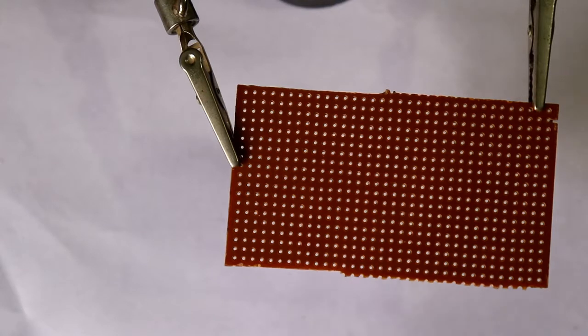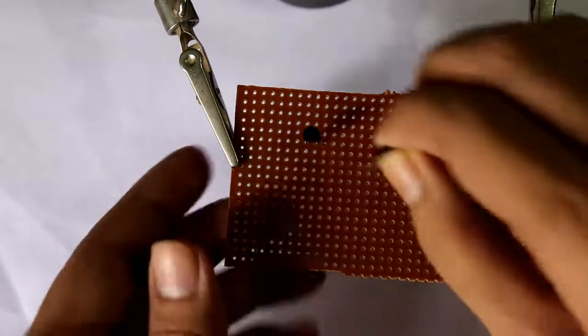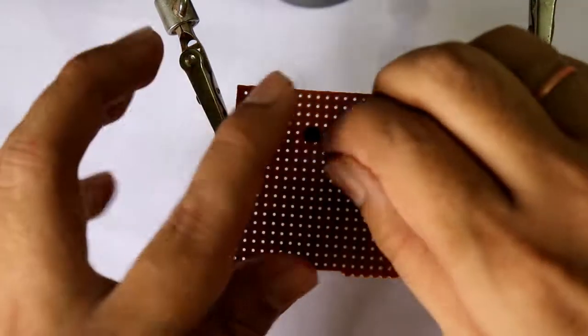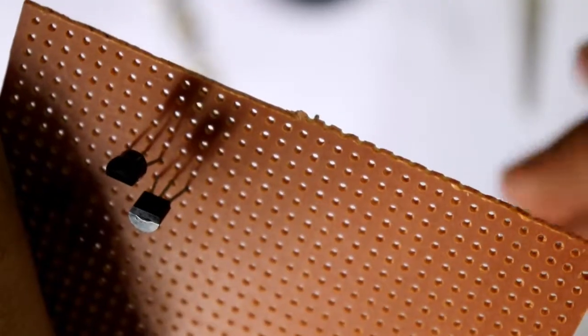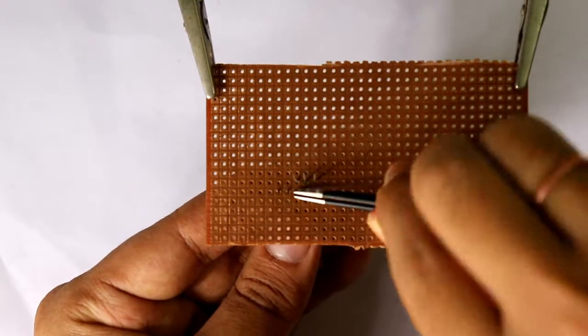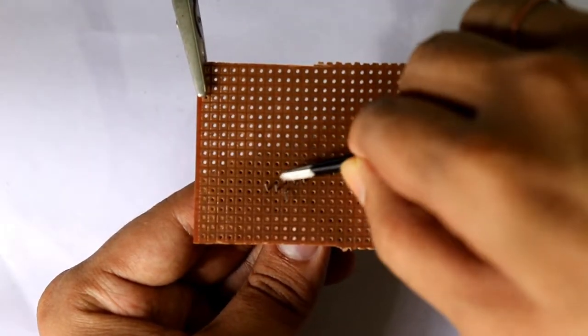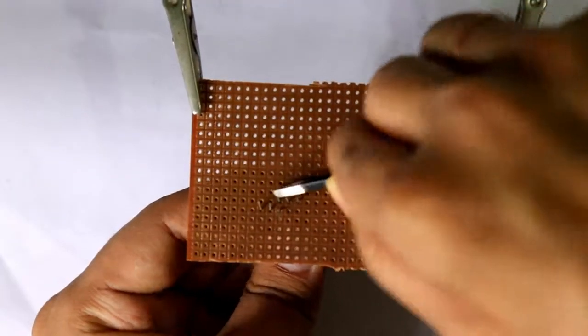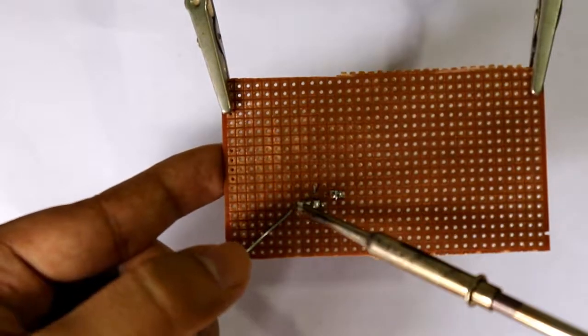For the PCB I will first place the two transistors and keep both emitters of the two transistors closer together. I put one transistor vertically flipped like this. After flipping the board, just bend one lead of the transistor - it will be easier for soldering. Now the transistor is soldered.